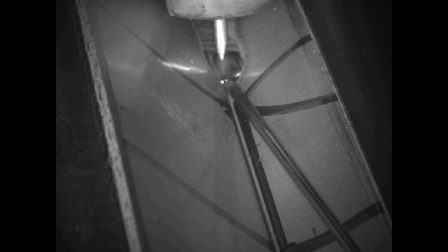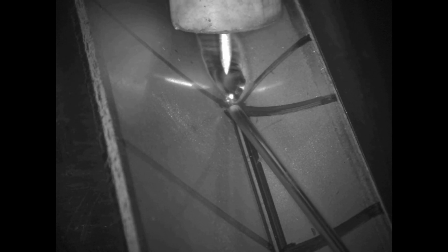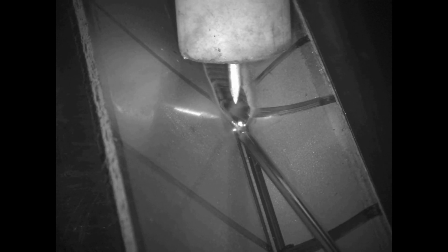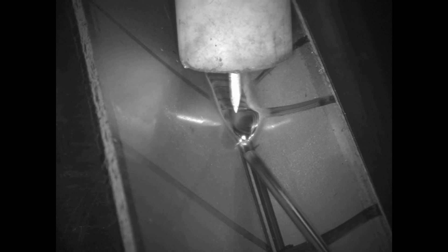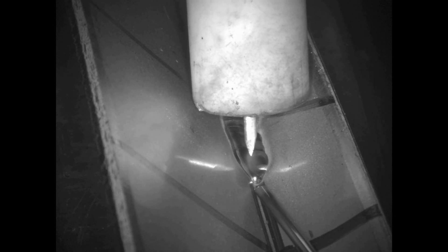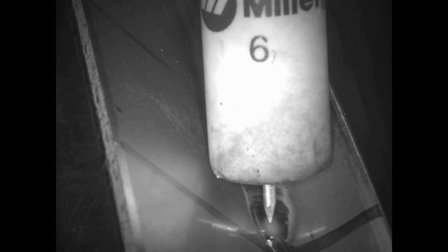Here's the middle section. You can see you're striking the arc and it's getting liquid, then you just continue on with the weld. Restarting with TIG is pretty simple — you just get to the crater where you stopped from the first weld, get that crater to start to melt, and then start adding metal as you go. You can see right there I got a little crooked. Just dab right across the plates.